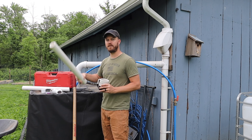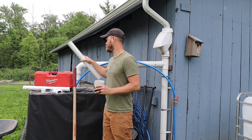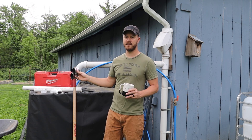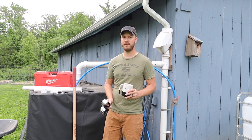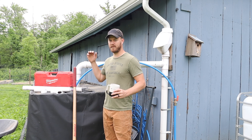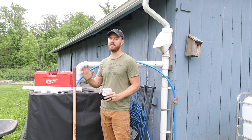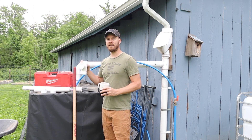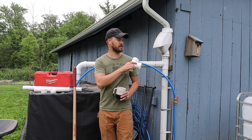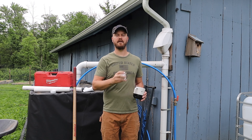You're also going to need some 2-inch PVC, since the rest of our piping is 2-inch PVC, so let's keep it the same. You're going to need couplings — because I'm connecting to the existing system and setting up for an additional one in the future, I have two of them. I'll probably end cap it for this project and come back and cut it off when necessary, which makes things easier and ensures it won't leak. You also need a T or some kind of bend for your PVC so that it will connect to the IBC tote.